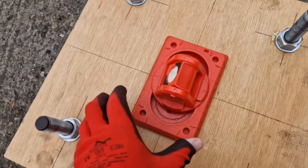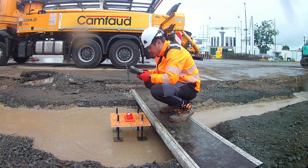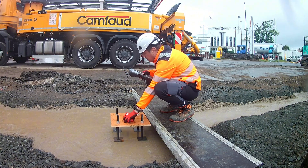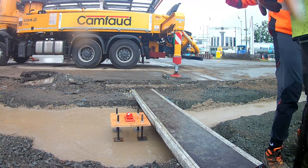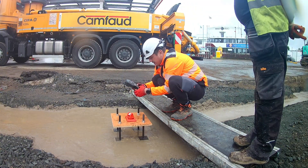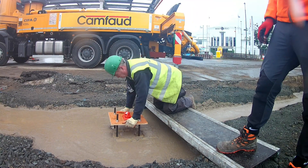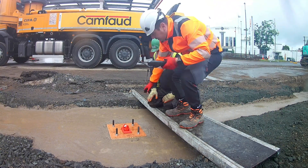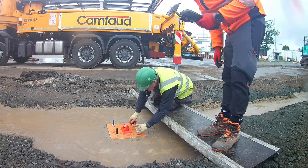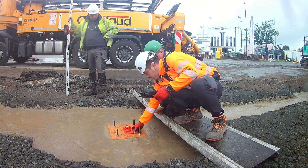I'm here on site. I want to mark some ball pads and I'm going to use this tool. If you've ever positioned fixed anchor bolts before, you know that the tolerance is very tight, and the concrete needs to be not too soft so the bolts won't float, but also not too hard so you can sink the anchor bolts. When using a mini prism, the biggest challenge is that you need to keep the prism plumbed while looking at the controller and slowly reposition the ball pad. By using the RS-150, there is basically no need for plumbing because the RS-150 is almost flushed with the ball pad — it's only 50 millimeters in height.